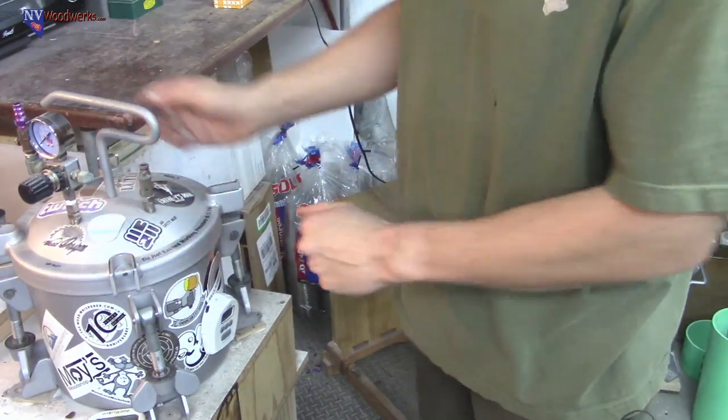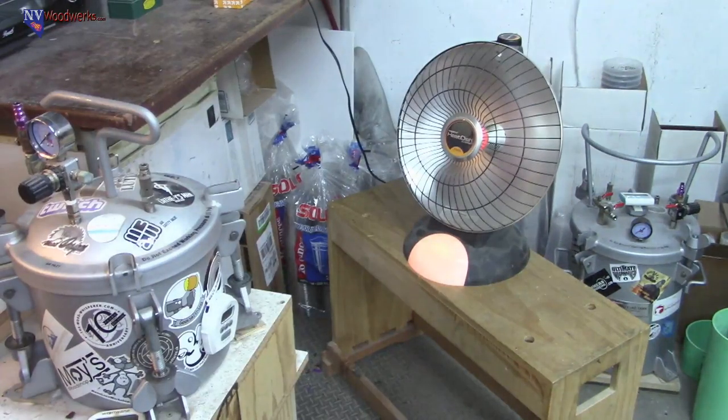Once it's ready to be pulled out of the pressure pot, we have a little office room. I put one of those little space heaters in there and that room is at 70 degrees. So I'm leaving all my resins in there overnight, and anything I don't want subjected to cooler temperatures goes in there, including the blanks. Once I pull them out of the pressure pot, I take the brick and let it sit in there until I get ready to cut it up. I know a lot of you are working in a garage workshop that's not heated, so there are ways we can get around this stuff.